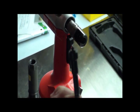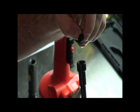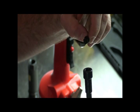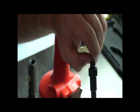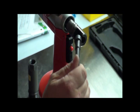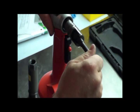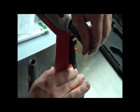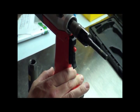Next I'm going to pull the mandrel toward me, which will show you the hex drive inside. I can go back in with a new 3/8-16 mandrel or any one of the mandrels in the kit — they all use a hex driver that's magnetic. I'm going to make sure that's seated correctly and go back into the tool. There's a cutout here; I'm going to make sure that hex driver just slides right in.